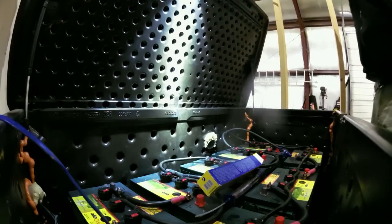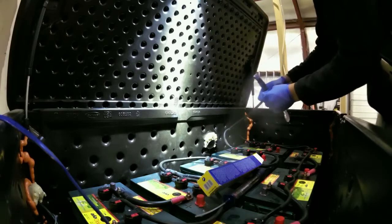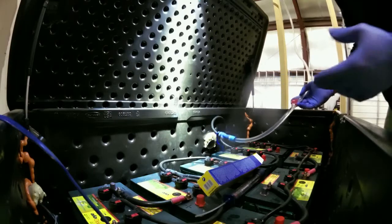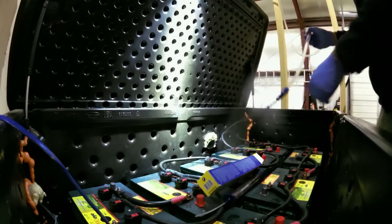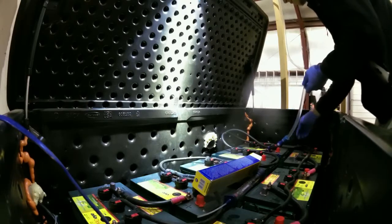I'll show you how the auto watering kit works real quick. Put a little water in there, it has a hose and a wheel to tell you when it's taking water. On one end of your auto watering kit there's a little nozzle — just take it, connect it up, and if there's any water for the cells to take on, this wheel will spin. When the wheel stops, you've taken all the water you need. I usually shake it a little and give the hoses a little thump just to make sure there are no air bubbles stopping it.